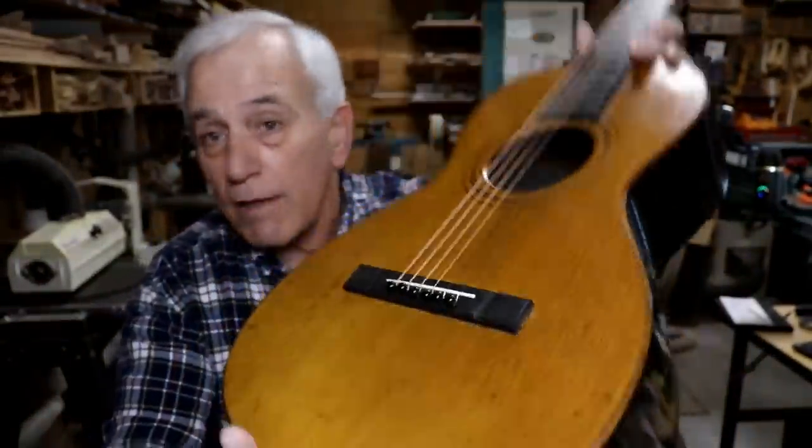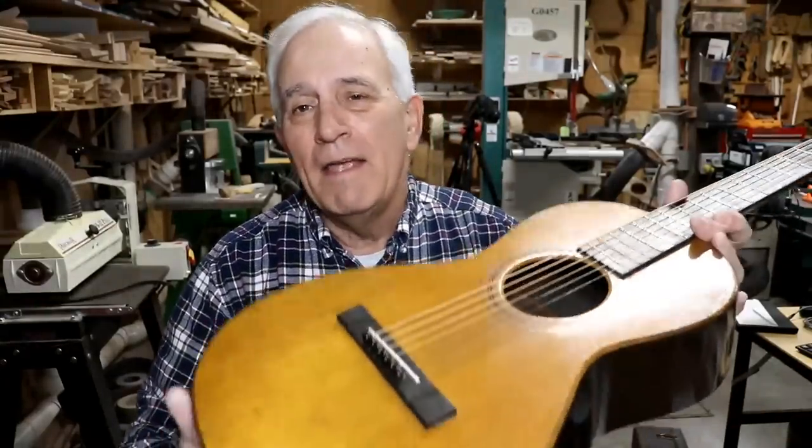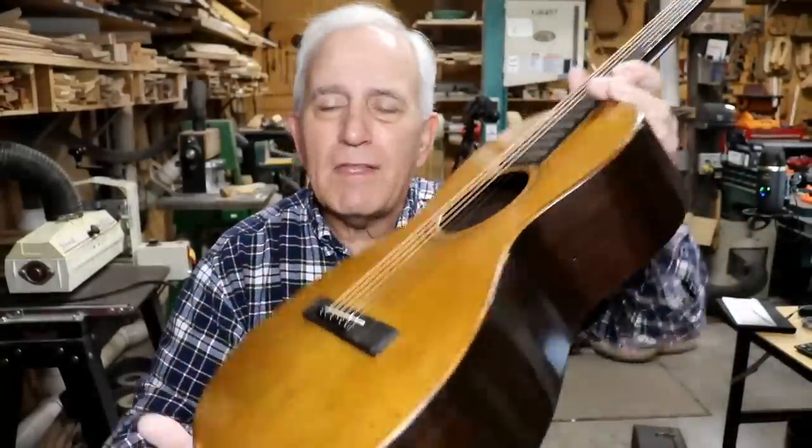This thing, as far as I can tell, has never been humidified in its life, and it looks perfectly fine. There's nothing wrong with the instrument. You might say, well, you fixed it - it was coming apart. Sure I did, but it was coming apart because of hide glue. Hide glue alone will come apart due to too much moisture, too little, too much heat, or too little. It's going to come apart in 140 years - there ain't no doubt about that. But I glued it back with Titebond and I don't think it'll come apart again. Looking at the finish on it, it's basically perfect. It's 140 years old and I am positive it's never been taken very good care of, never been humidified. It came in that old wooden coffin case and if anybody cared about it, they'd have done something - it was just flopping around loose in there.